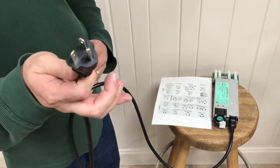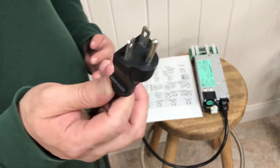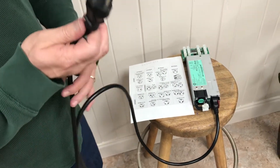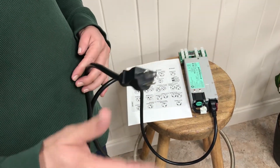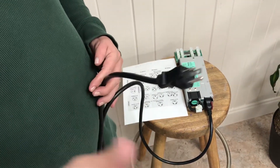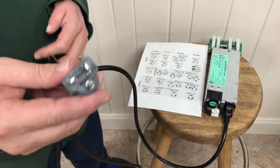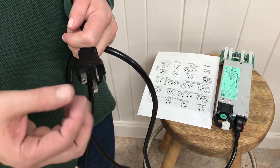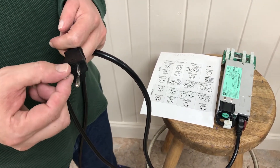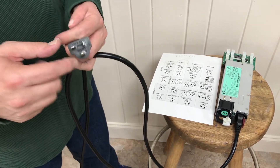And you can get it with this kind of end — that's for the NEMA 6-20. You might hear them called 220; that's just slang. The other one is called a 110. If you hear somebody say they've got a 220 in their basement, this is the kind of connection they're referring to. It looks a little similar, but notice this side — that prong is sideways. That distinguishes it.